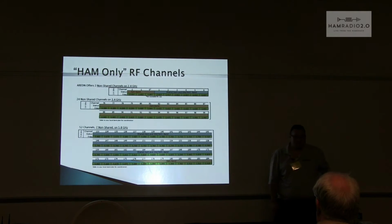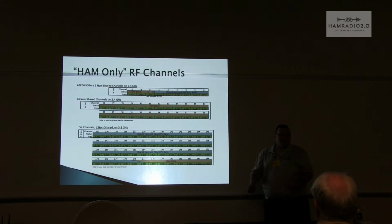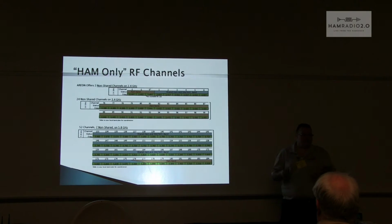And we had links even in our city. I showed you that distributed. 20-mile links off the back of nano stations started coming up. Not the best links because they weren't aimed at each other, but 20-mile links off the back of an antenna when you're aiming away from each other was pretty darn surprising for us. So it opened it up. It's definitely allowed these links to occur, especially in the urban built-up environment. You need to have that free and clear bandwidth, we're finding. So that gives us that.